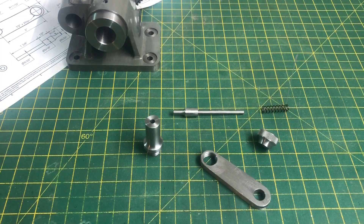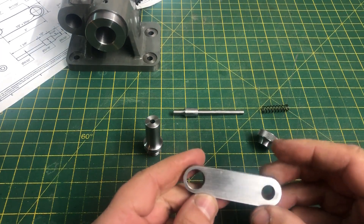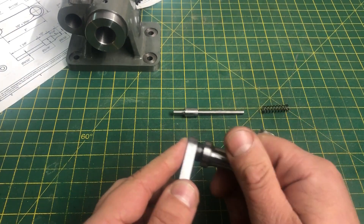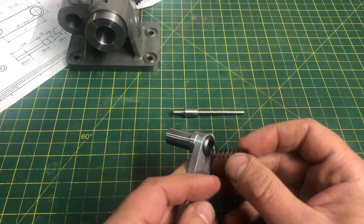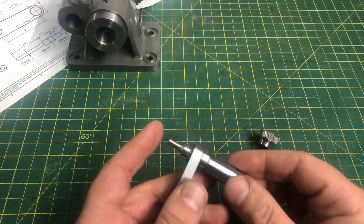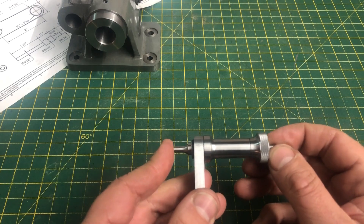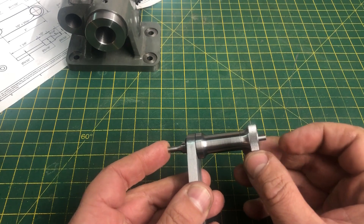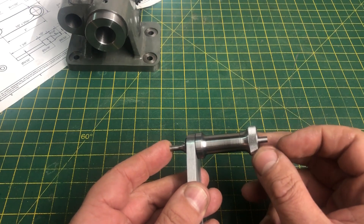Let's have a look at how all of those components go together. The bracket is now threaded and tapered. I have run a file over all of those milled surfaces and the body looks good, with a nice fit in the bracket as well. It takes a spring, which is supplied in the kit, and then the plunger itself, which is a reasonable fit in both of the bores. And finally this is all backed up with the knob. I have made the shaft over long as I want to adjust the stroke once I have the holes drilled in the gear. In my mind it is the curved part of the plunger that should register in the hole, and from what I can tell the dimensions on the plans don't allow for that, so I'll need to finish this to suit later on.